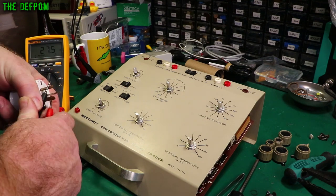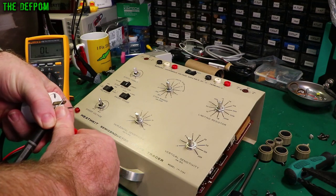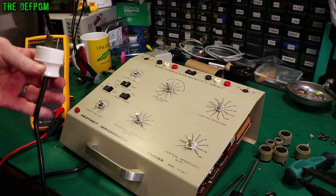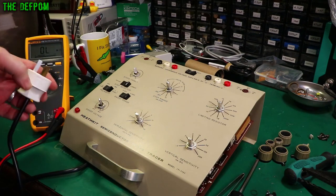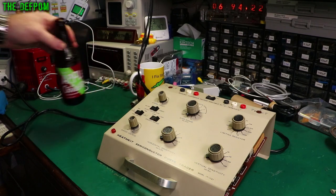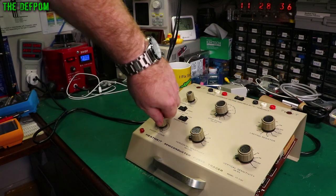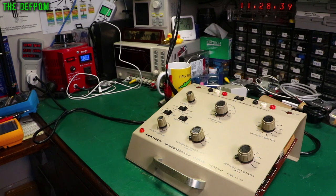Between phase and neutral I'm getting 27.5 ohms across the transformer, which is probably okay — that works out to about one amp. The earth pen shows nothing. On the surface it appears okay, but I'll have to do a proper insulation resistance test as well. First power up — is it going to work, is it going to go bang? Switch is currently off. Let's turn it on. Seven watts — that looks fine. Power factor 0.39 and it's drawing 80 milliamps. Looks absolutely fine. There are no X-rated caps in this, so it should be pretty safe.